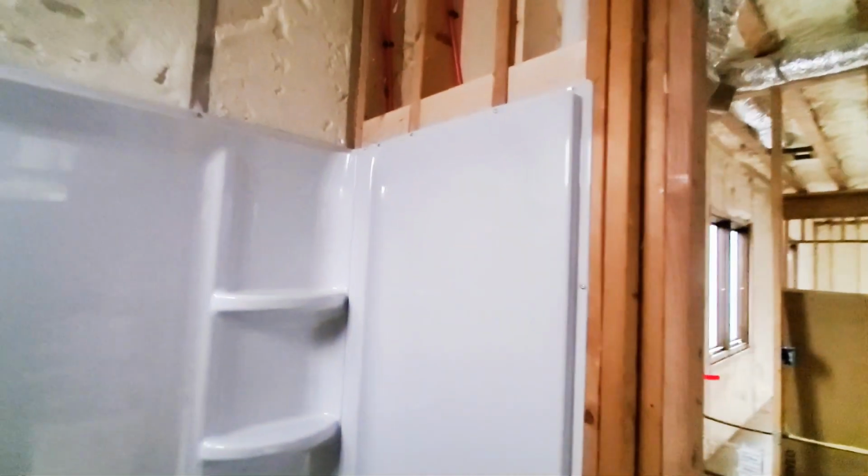I suppose if I had planned this out better, I mentioned earlier when I was doing all the blocking, it would have been nice to just have OSB around the whole outside, or something that's solid. That would have done a lot better in dealing with this. I know I put a lot of blocking in this side, or both sides, and it's actually pretty firm there, but you can see how that is bending, pushing. Probably be fine, no big deal.